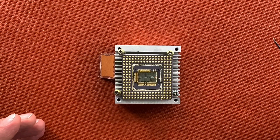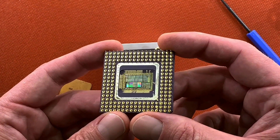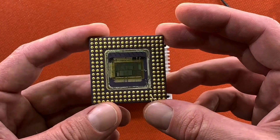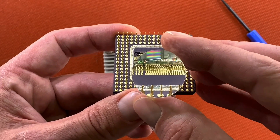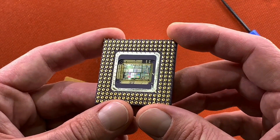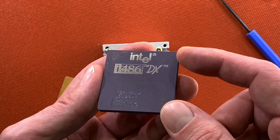We have to cool it down a little bit before we can touch it, so let's wait. Everything cooled down already, and now we can check our silicon die — very nice and shining. You can clearly see the nice structures. I'm really curious if this CPU is still in working condition. I'll quickly check the bond wires with a magnification glass — they are not bent or damaged, so I'm pretty sure the CPU is still working, and we'll check that later in the video. The only thing that got affected is the color and printing on top of the CPU, which usually gets brownish due to the heat.